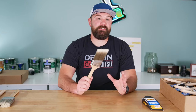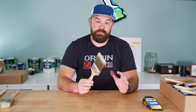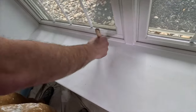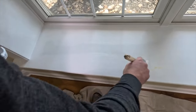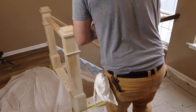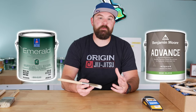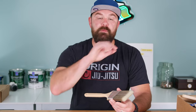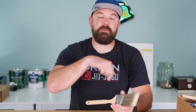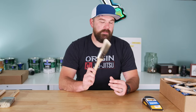Onward to the three reasons why I like this brush. Starting at number one is versatility. This brush can be used for both interior and exterior paints, which is super nice. It's got enough precision and softness of the bristles to lay down trim paints, but it's also got enough structure to lay down some of the thicker exterior paints. You can also use it with oil and latex-based paints, and it also does really well with the hybrids. We were using this brush for ceilings, walls, and trim. It does particularly well with hybrid paints like Advance and Emerald Urethane. If you're only going to stock one brush in your quiver of brushes, this might be a solid candidate.